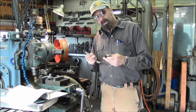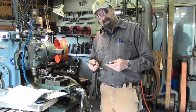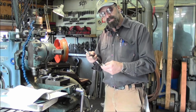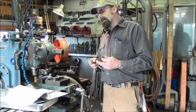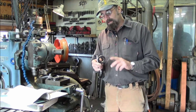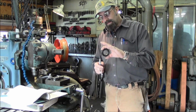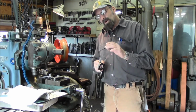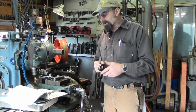And it's very important. When you're learning a machine, you're learning what practices normally apply to certain things, like bearing fits. And the bearing actually has two fits. You've got a housing or an OD fit, and you have a shaft or an ID fit. And there are different practices for different applications on those.